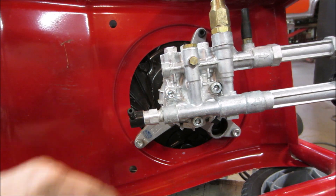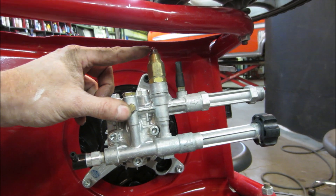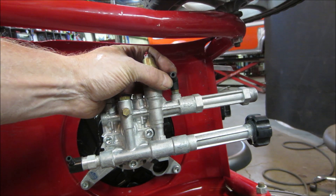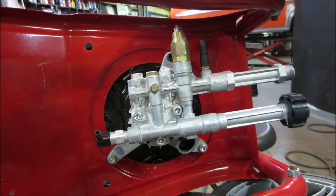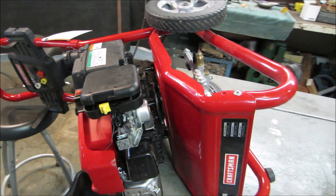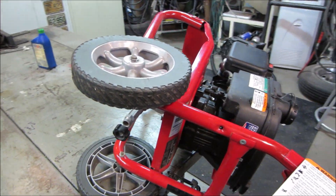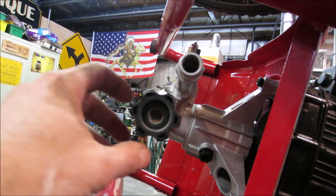I haven't had one of these cheap ones apart in a long time. This is a pressure relief or pressure adjustment — that little jam nut and set screw in the top — and just fluid in, fluid back out under higher pressure. You're not supposed to run them without water going through them. The last decent pressure washer I worked on, I got called out for firing it up without water, but that one had already been run about 100 times without water so I wasn't doing any more damage. Let's take a quick look. There's a screen there — looks like a little bit of crud. I'm going to hit that with an air gun and blow some of the crap out.